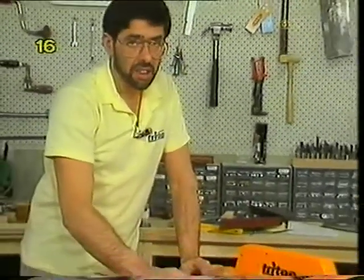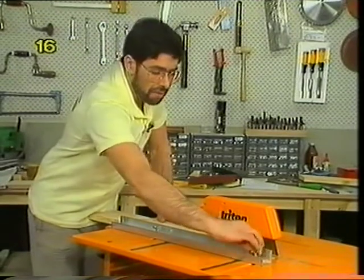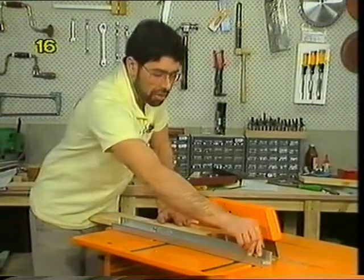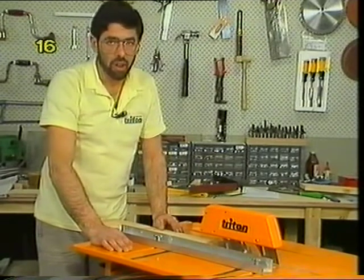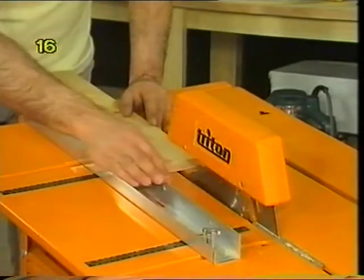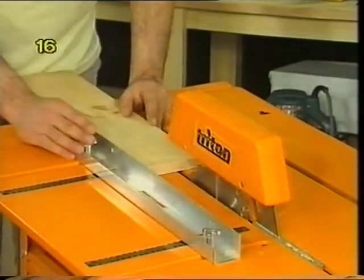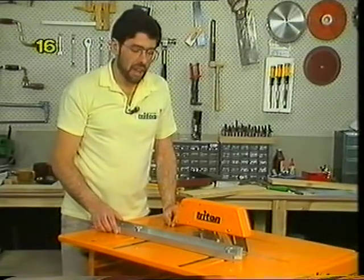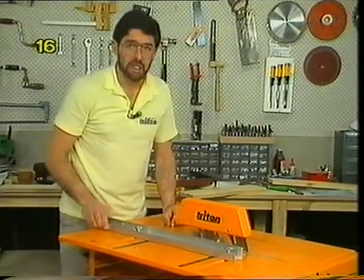You may find some circumstances where you'll want a slightly higher reading in the rear window than in the front — no more than one millimetre or just over a 32nd of an inch — giving yourself some relief or escape at the back. You do that when cutting green timber which tends to bind on the saw blade, very badly dressed material, or if for any reason the workpiece is jamming between the fence and the riving knife. Otherwise, absolutely parallel front and rear. Every time you've set the fence to a new position, double check that it's properly locked at both ends.